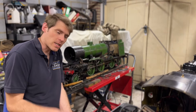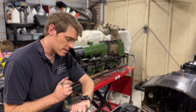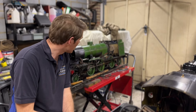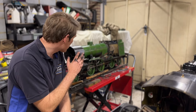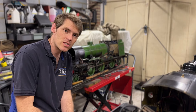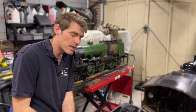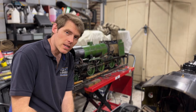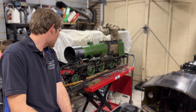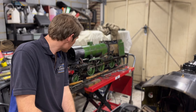As you can see, the boiler is not quite off - that is just over an hour's work to get to this stage. What I found was the boiler is a bit too attached to the smokebox to pull apart easily, so I'm going to try and take the boiler and smokebox off in one piece. Let's just hope it comes nicely.